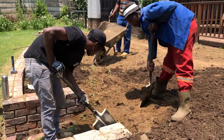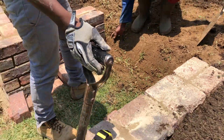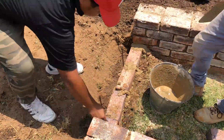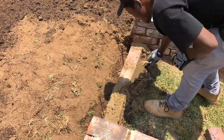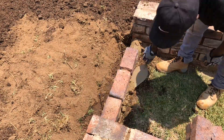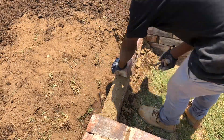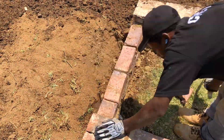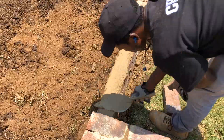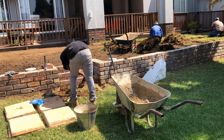Whilst the channel drain is going in, we are getting the patio paver pathway ready. We're laying down the concrete foundation and then building up some brickwork as the first course goes in, which will form the back part of the first set of steps. We're also using some rebar to reinforce and add an extra layer of strength so that the soil we're backfilling with doesn't push the step over. Once we've got a couple of rows in place, we'll backfill and then add a screed mix on top, which will create the foundation for the patio pavers. Here's a beautiful montage of the mad dash to the finish.